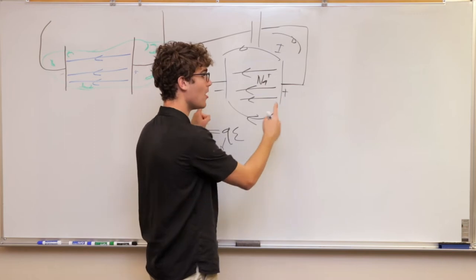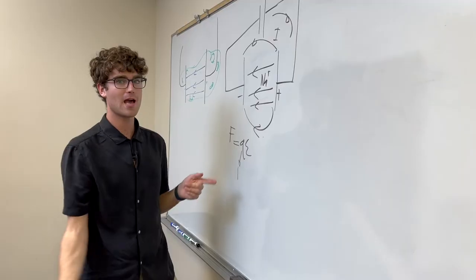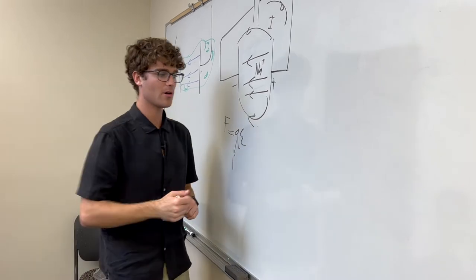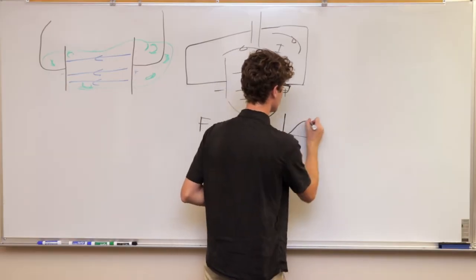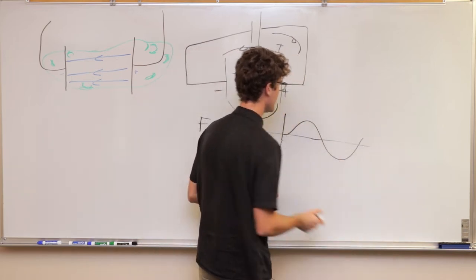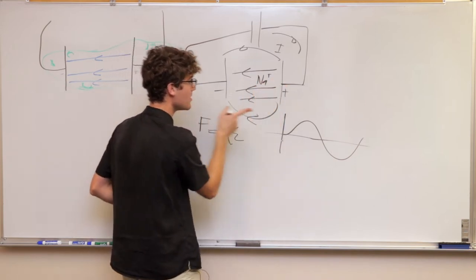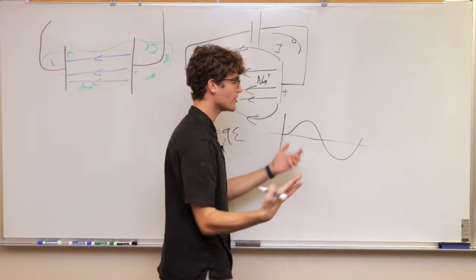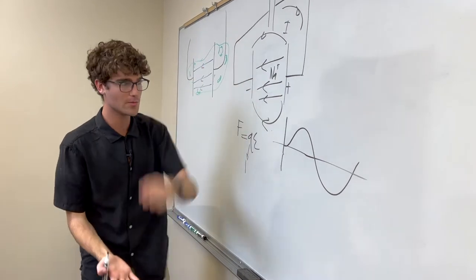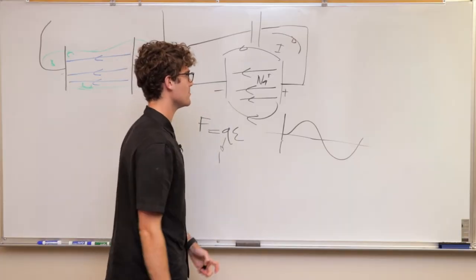Now, if we're having alternating current, that would mean that this positive and negative switch, and in Germany that happens at a frequency of 50 hertz, so 50 times a second, these two alternate. And it's not just a hard on-off, it alternates in a sinusoidal current of, say, this side being positive, and then negatively charged, and positively charged, and then negatively charged. Now that's going to mean that this sodium ion is going to experience a force this way, and then that way, and then this way, and then that way. It's going to start bumping into other sodium ions and maybe exciting electrons and absorbing electrons, emitting photons at the characteristic wavelength that sodium emits light.